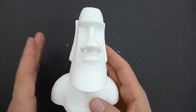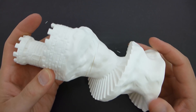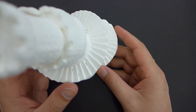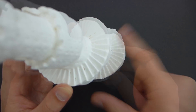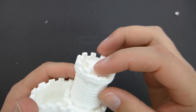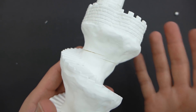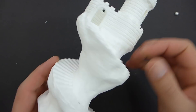I already talked about where it split — this was not dropped, this is just the filament actually splitting when it cooled and dried, which was disappointing. Other than that, it did really good on the rock foundation. You do see some holes in the steps, which are pretty hard even for most filaments at higher infill. There's a tiny bit of lifting on the very outer edges, but it still held for the most part. The bricks came out great. I did knock it against something, so two of the tower teeth had fallen off. But after learning my settings, there are no holes from retractions. I did slow it down for much more consistent extrusions throughout.